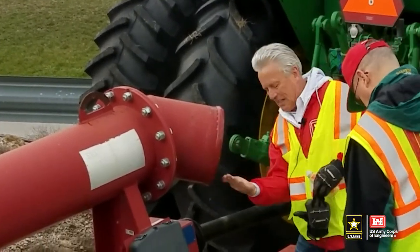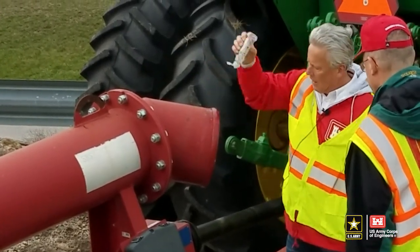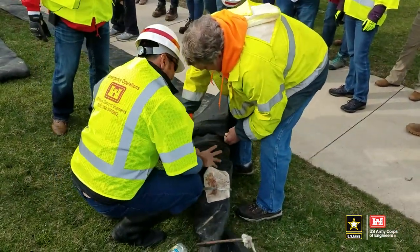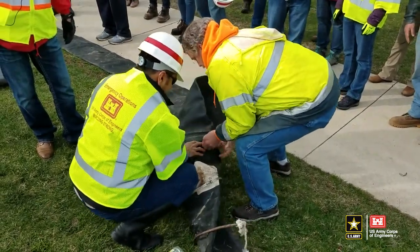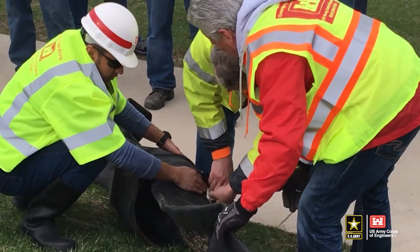In cold weather, a heat gun may also be used to make the hose more pliable, but care must be taken to ensure the hose is not damaged. After the first hose is attached to the pump, continue assembling additional hose sections by taking the hose with the embedded hard ring and inserting it into the end of the next hose with the soft ring. Ensure the soft ring on the second hose is placed at least one inch past the solid ring in the first.